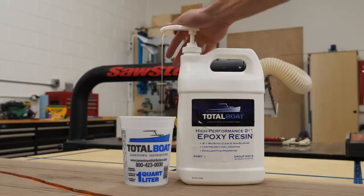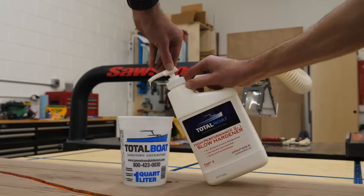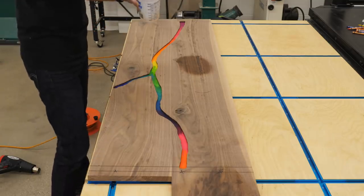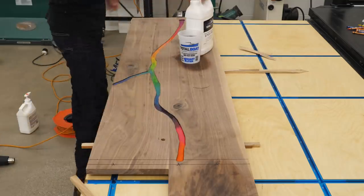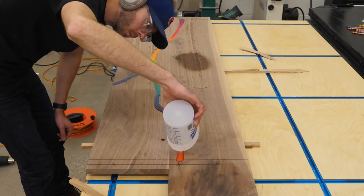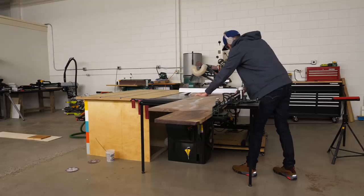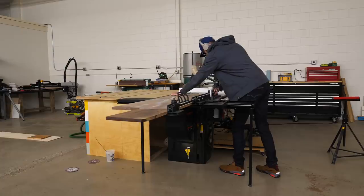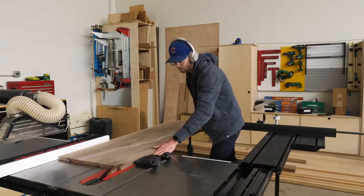The big difference between this table and the last table is that this one's gonna have a top coat of epoxy about a quarter of an inch thick. This was actually my first time using epoxy on a project, so I'm definitely no expert, but I'll throw a link to what I used in the description so you can learn more about it if you're interested. After the top was dry and I had knocked the epoxy back to flush with the wood, I used my table saw to cut the whole thing down to its finished size. The reason I did this after I poured the crayon and the epoxy was so that I didn't have to worry about it all spilling out, since the rivers go to the edge of the table.